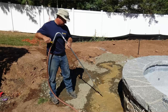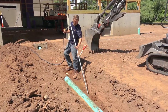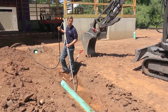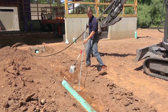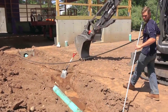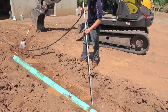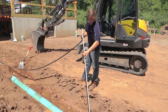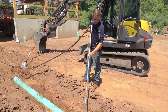This also works great for when you're doing pool patios. A lot of times around the edge of a pool, the pool company does not backfill properly — they just push the dirt and fill around the pipes, creating voids underneath. No matter what you do on top — running a jumping jack, plate compactor, any compaction equipment — it's not going to do anything. The best two forms of compaction are water and time. Obviously in a situation like this, we don't have time for it to sit, so we're using a forced water system, forcing water into those joints and voids so that we don't have to wait.